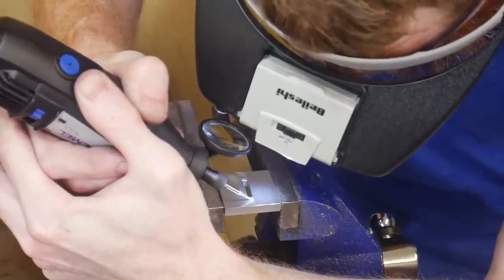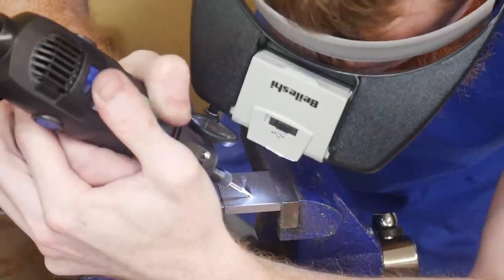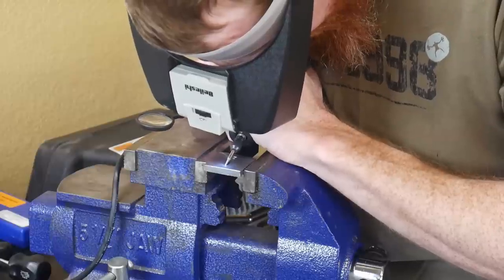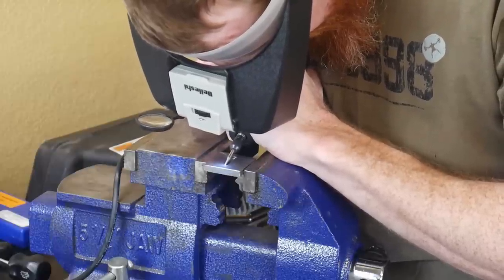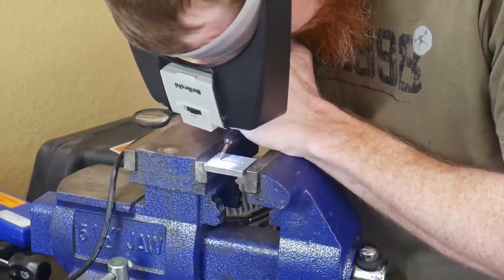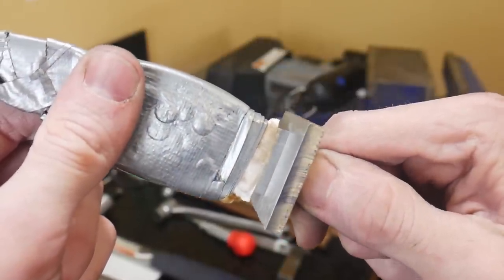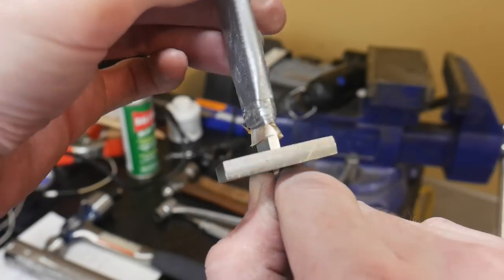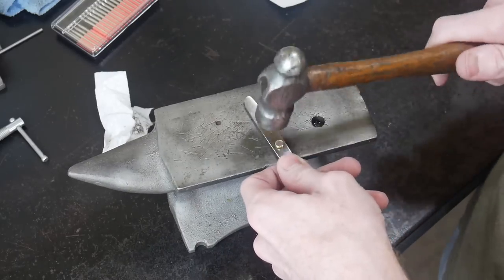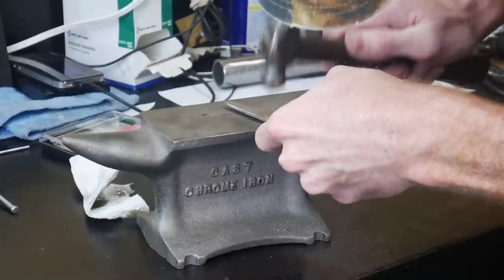You take away a little bit where the shoulder's hitting, coat it with a Sharpie, hammer it onto the knife again, and keep going back and forth removing material until the guard fits up over the ricasso. This method, while time consuming, worked out pretty good — I was able to achieve a very nice guard fit with no visible daylight. I'll definitely do it again; I think I'll be able to do it faster next time, but you've got to be really careful with the Dremel tool — it wants to walk on you every once in a while and you can really mess up your guard.